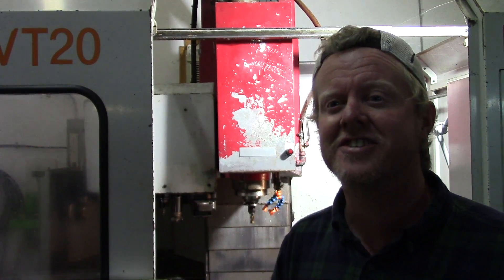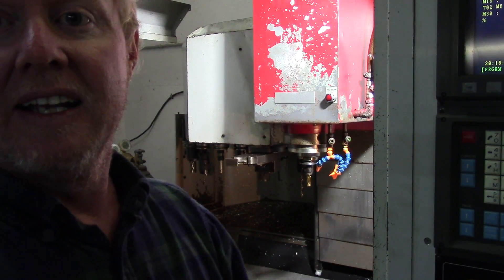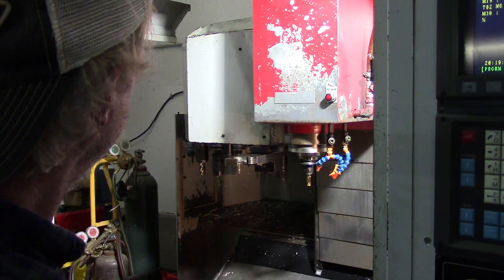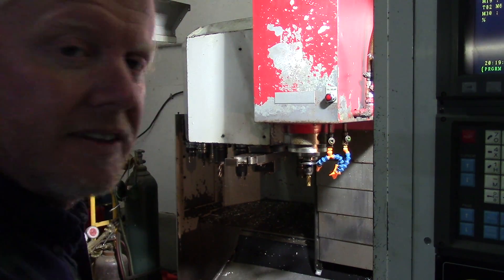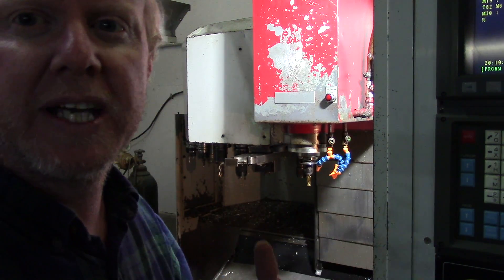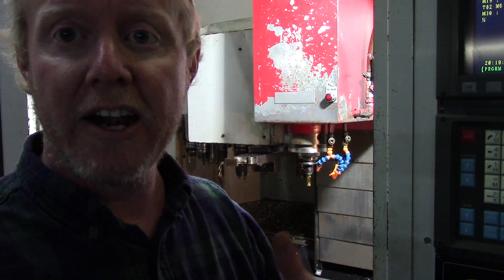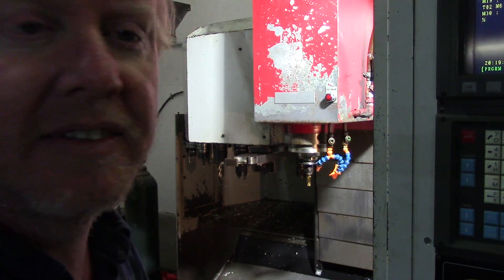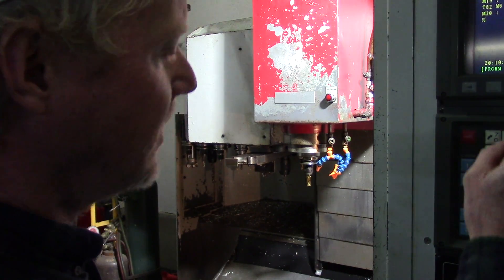It's really nice that the air compressor is not cutting on every five seconds. Let's give this a try. I've got it in the tool change position and now we get a really smooth tool change — way smoother than it's ever been. It works exactly like it's supposed to, it's a lot quieter now. Assuming probably since I had the machine, even when there wasn't idle air running through that cylinder while it was moving, it was probably letting a lot of air escape and not moving as efficiently as it could.